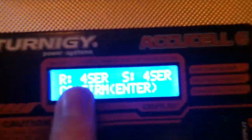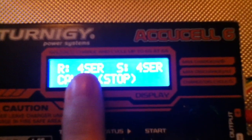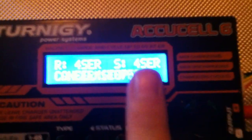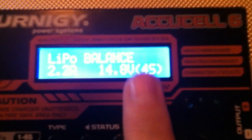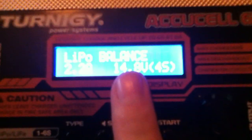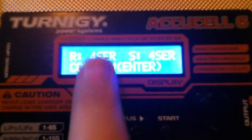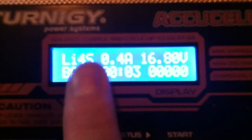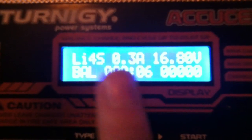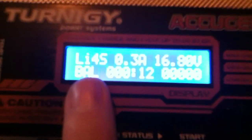The R and S readings with the four numbers here are important: R is what the charger detected — it detected a 4-cell LiPo — and S is what I've selected and inputted: 2.2A at 14.8V, 4-cell. As long as R and S are identical, we're good to go. Push Start once and now it's on the charging sequence showing your 4-cell LiPo, input amperage, voltage, charge mode (Balance), and elapsed time.